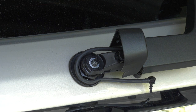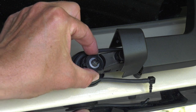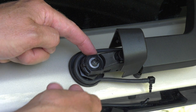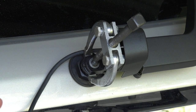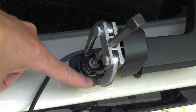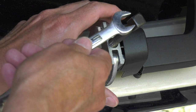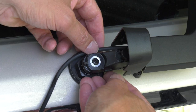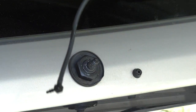Once the bolt is off, the arm itself is actually on a tapered fitting. You're most likely going to need a blade puller that they sell off of Amazon, or if you have a wheel puller like I have, you can use a wheel puller to basically put some tension on the arm and then pull it off. Here's what the wheel puller looks like when it's attached to the arm and the bolt itself. You just pull in some tension on the puller itself, and once you get the wheel puller to release it from the tapered fitting, the arm should come off fairly easily.